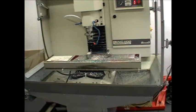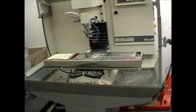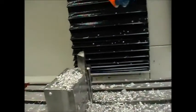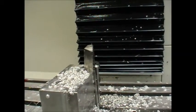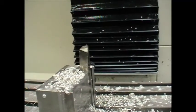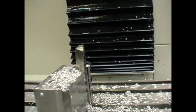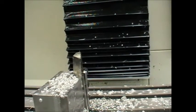I found out that both of those issues are non-issues with the correct approach — with the right chip breaker on the tool. This is a high speed steel tool that I've ground up with a little top rake scallop ground into it, that forces the chips to break into little pieces. That gets around the automatic running swarf control side of things.